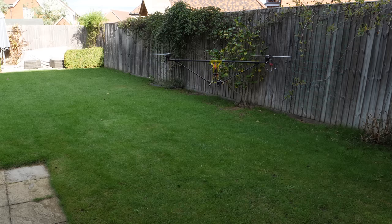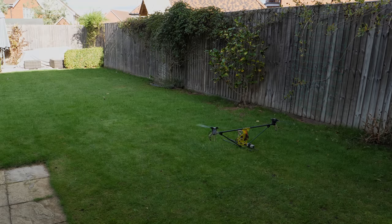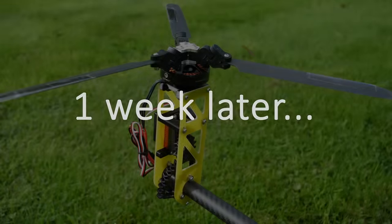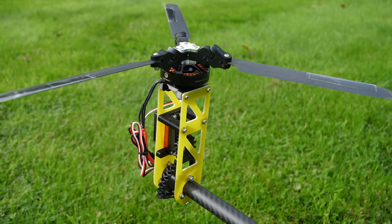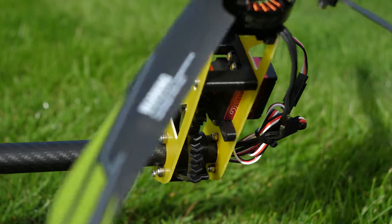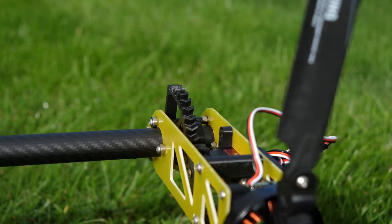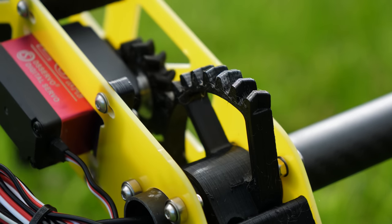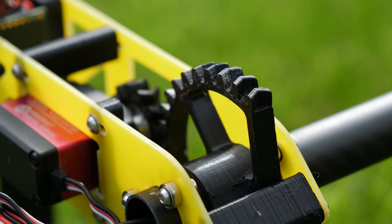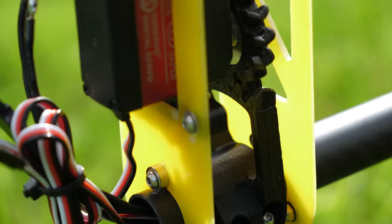The pitch control with the 3D printed rotor heads works surprisingly well and the motors stay nice and cool. All it needs now is a stronger wing spar and a completely redesigned motor tilt mechanism. This may look similar to the previous design, but it's got a few major improvements. The most obvious being the new herringbone gear system to tilt the motor, which removes the play from the old pushrod. Also these cheap servos aren't the most precise, but have about 300 degrees of travel, so it's geared with a 3-to-1 ratio as we only need the tilt mechanism to tilt about 100 degrees.